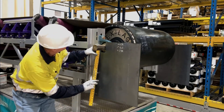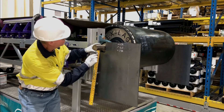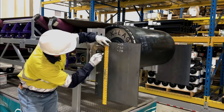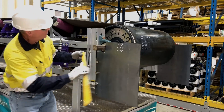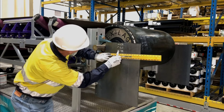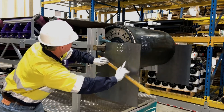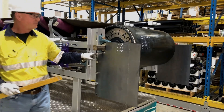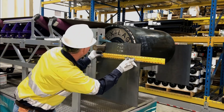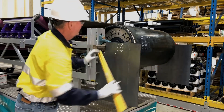We're going to go back to our two plumb lines, measure between those to get the center of our shaft, then go half of that. This line will represent the center of our shaft. From here we're going to measure out six and five-eighths, which is our X dimension, and draw our plumb line.